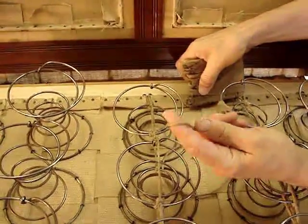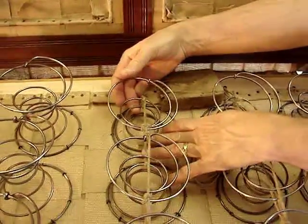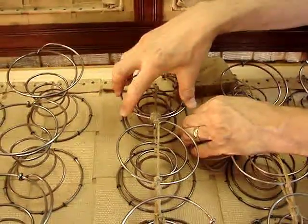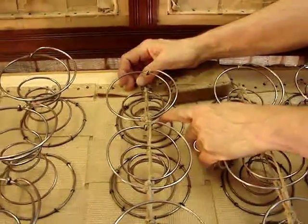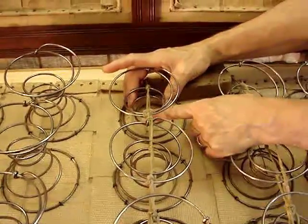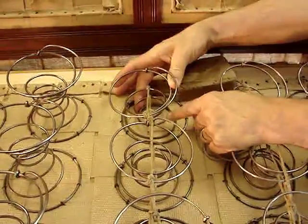I've cut a piece of twine to show you a strategy for truing up funnels that want to canter off in one direction or another. One of the strategies for springs is to make certain that the funnel, as it compresses, is doing so vertically. If the funnel has the opportunity to canter off, you're not going to gain all of the resistance you typically would from the spring, especially since the central portion of the funnel is where the greatest amount of tension occurs. Over time, the funnel can lop over to the degree that metal fatigue will form and the spring will actually break.